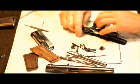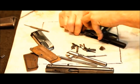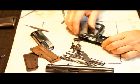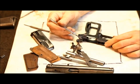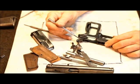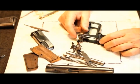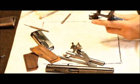Now your sear spring is this long flat spring here. That'll bring the hammer back a little bit and that'll release that to where it should come up and out like so. There's your sear spring. Now this is your ejector. This ejector kind of rotates around once you get the pin out of it. Once you get the sear pin out, the sear pin keeps this ejector in place. Now, in order to remove your safety, you can't just pull it straight out and it won't come out. You have to rotate down this ejector. And then you should be able to just push that safety from the other side. You might have to tap it a little bit.